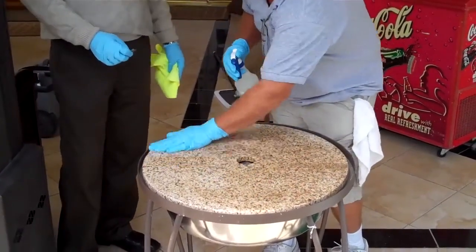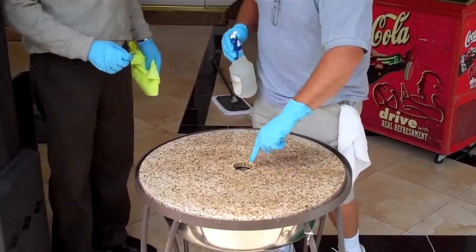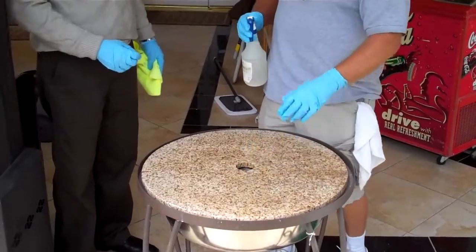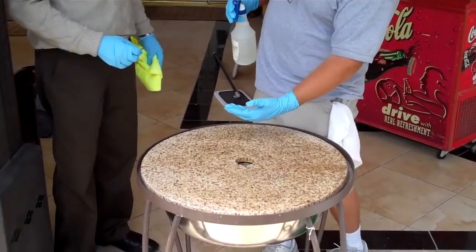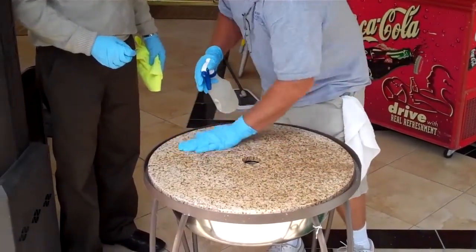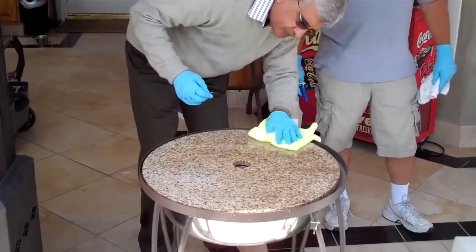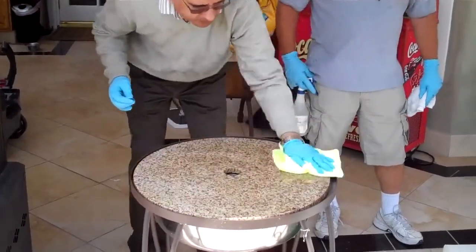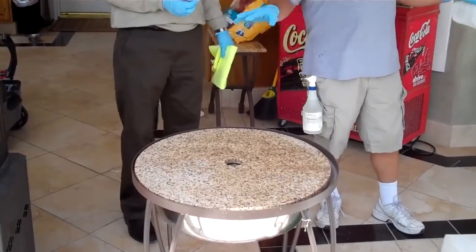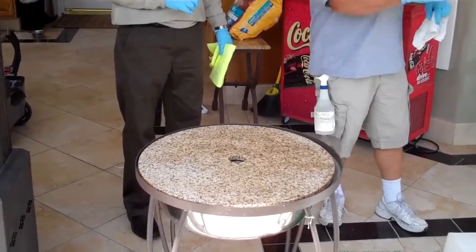And if it's a soap hole dispenser, you want to get clear caulking and rub that inside the hole — that way it'll keep the soap from soaking in. You see how dark this has gone? This is very coarse — the thickest polymer that we use. So what we're going to do is coat all these first, then go in and seal the floor and let these cure. Once we're done in there, we'll come back out and put the final four steps on.